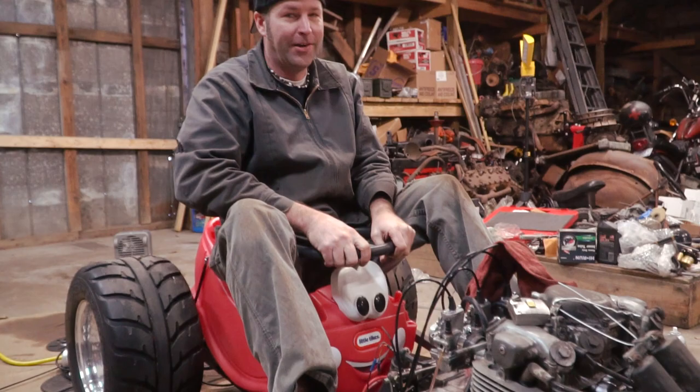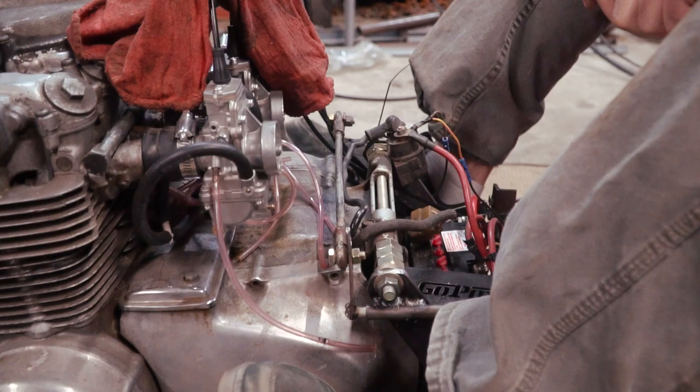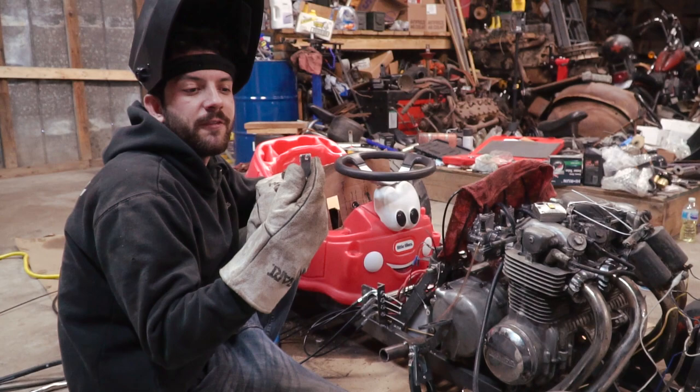My foot fits here pretty good. Clutch. Dude, it's great. I like that a lot. Clutch — letting out. We can shift without pressing the clutch, but I like pressing in the clutch. Ike cut me this little tab. I drilled a small hole in it, cut a slot in it for the cable to go through, and then I countersunk it with a bigger drill bit. Now we just need to set it up here.